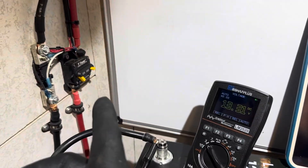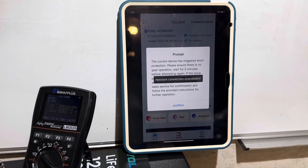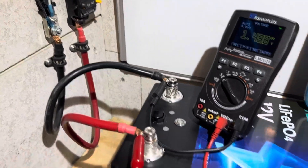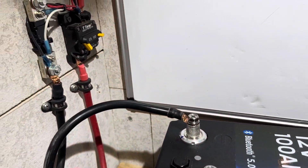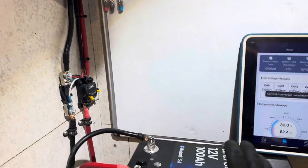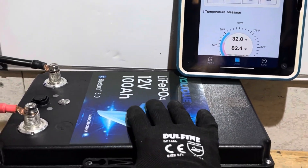Initially I pre-charged the inverter before I closed the breaker. It triggered again — 'the current device has triggered short circuit protection,' with a five-minute timeout. You have to use the pre-charge resistor on that BMS, which I usually do. I just wanted to see what it would do when trying to fill the capacitor bank. While waiting for the battery to come back online, I could hear what sounds like a fan running inside. Has it got a fan-cooled BMS? That's interesting — we'll find out shortly. There's definitely some kind of sensitivity issue with the BMS on this battery.